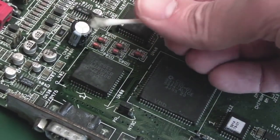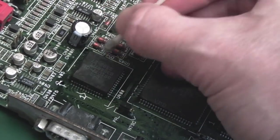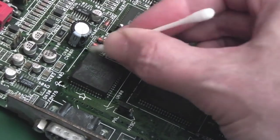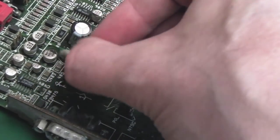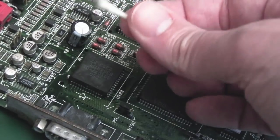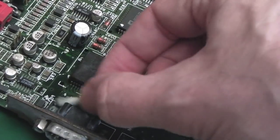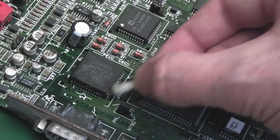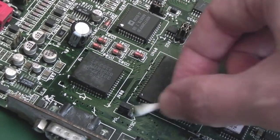But you see, this corrosion can sit between two pins, and it might not necessarily just eat things, it can cause conductivity. A bit of conductivity between two address lines, or two data lines, or control signals and things like that, and you've got a problem. You can see the silk screen just wiping off here, look, corrosion's that bad. So you never know, it might be something like that. If I can just get this to boot, I would feel a lot happier.